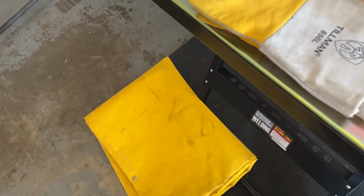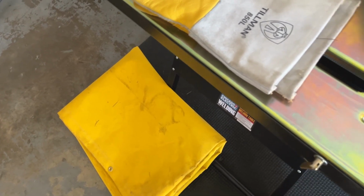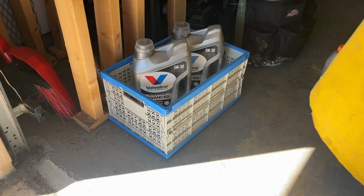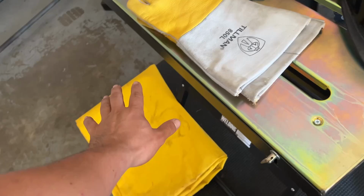Welding blankets or fire blankets are usually made of fiberglass and are flame resistant just like the FR clothes. This is a great option to cover flammable material, but be sure to consider this as a last line of defense. Distance yourself or the flammable object as far away as possible first and then apply the blanket.